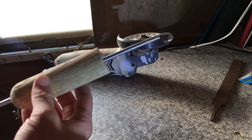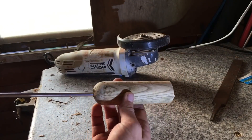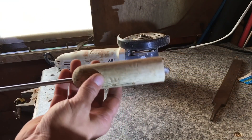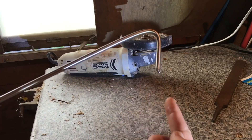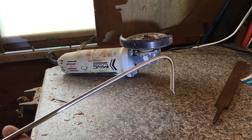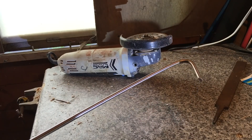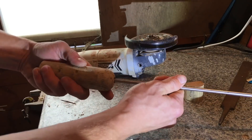The spear is all bent over now. I've slotted the handle on and it fits inside just like so, creating a nice strong handle. The idea is to keep the handle on when you bend this end, otherwise you're not going to get it on afterwards. That's the hook all bent now — as you can see the angle on the bar originally creates a nice hook to start pulling lobsters out with. It's only about two inches wide — you don't need anything big. It's just so you can get right into the holes and pluck them out — same goes for spider crabs, lady crabs, brown crabs, anything really.